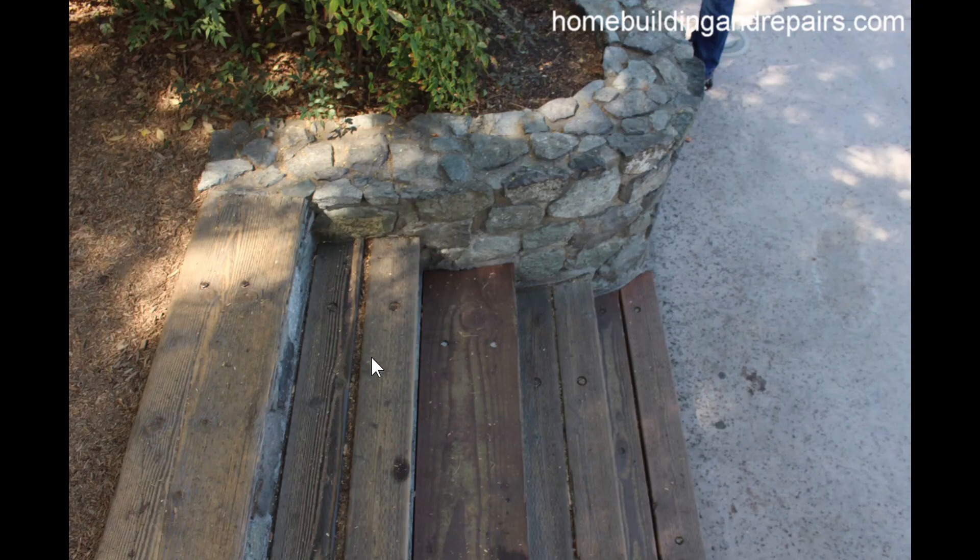Here are the steps, and here's one of the problems I'd like to talk about: the bolts sticking up, or the nuts. These are bolts, obviously, but if you did it the way I would normally do it, you would end up with a nut and an anchor bolt embedded into the concrete. So these are obviously a trip hazard. It would be nicer if it was at the bottom of the stairs — you do not want the trip hazard at the top. If you're walking down the stairway, this is going to be painful if you trip on it.